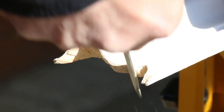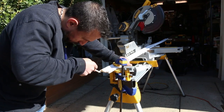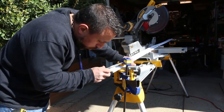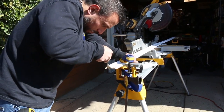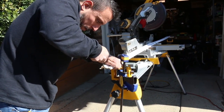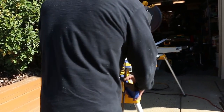After you're finished with your coping saw, you're going to want to get as close as possible, but you're going to leave some of the wood closest to the edge of the profile — that's just inevitable. So you're going to fine tune the joint with a good old file. Get it into fine tuning.